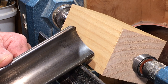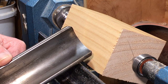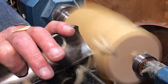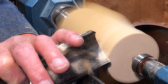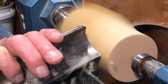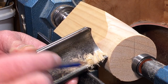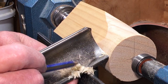This is a two inch deep fluted spindle roughing gouge, never ever to be used on facework or for roughing bowls. This gouge is used more as a peeling tool, so the edge is just below the surface of the wood, taking off a roll of timber, which is difficult to show on this radiata pine.